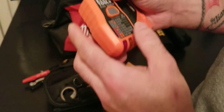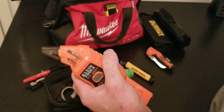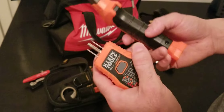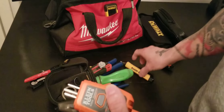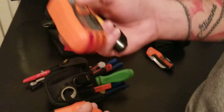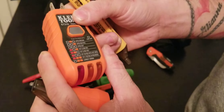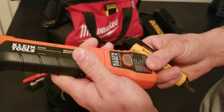Personally, this has never failed for me and I love it. It will tell you if your outlet is good. You can also use it as a circuit tracer — you plug in a light bulb adapter and it tells you which circuit you're on. If you're working in a room, the whole circuit passes through one of the outlets, so you can trace it. There's a lighting system that tells you if there's correct wiring, an open neutral, open hot, reversed neutral and hot, and other issues. It's really good to have.